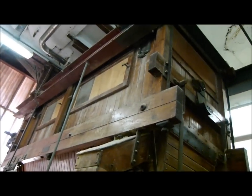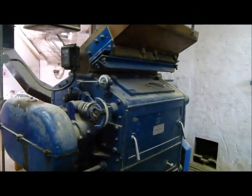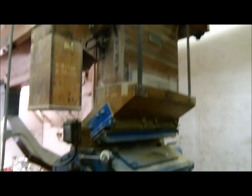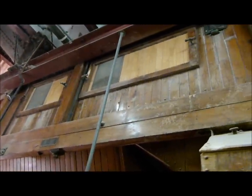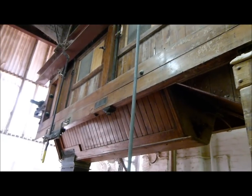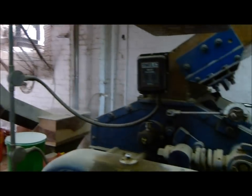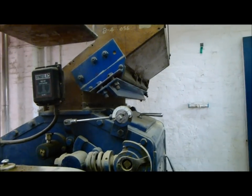This is the milling process and it's in action at the moment. There's a mill here that's over a hundred years old, and we're crushing grain for the next brew coming up — that'll be the second Spitfire this afternoon. It's being fed in from the silos. Now this wooden housing up above the actual mill — this is actually called a malt dresser. That's cleaning up the malt — taking out any husk, any dust, any stones, there are magnets in it to take any metal out, any thin grain. So you're only going to present good grain to the mills. And that malt dresser goes back even older than the mill — probably a hundred and fifty years old, maybe more.